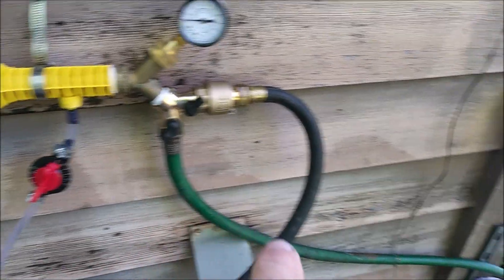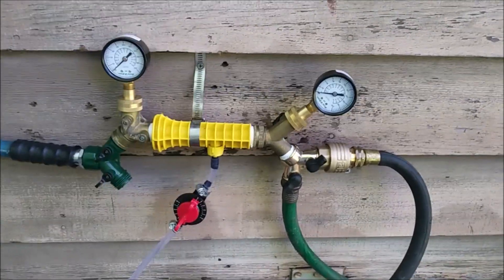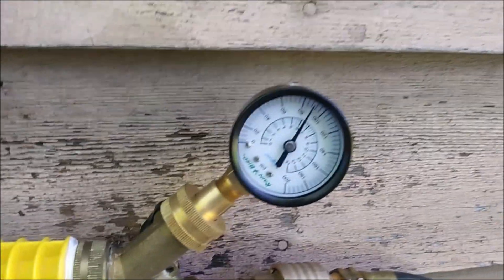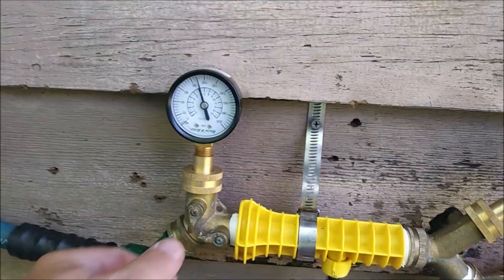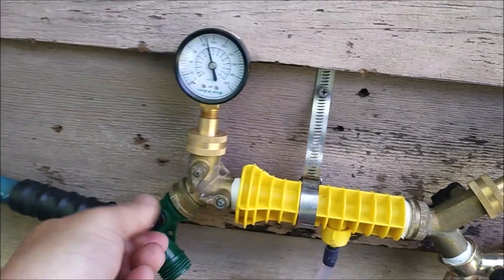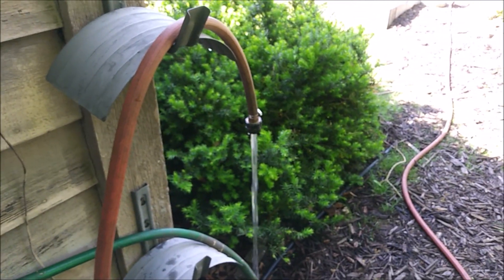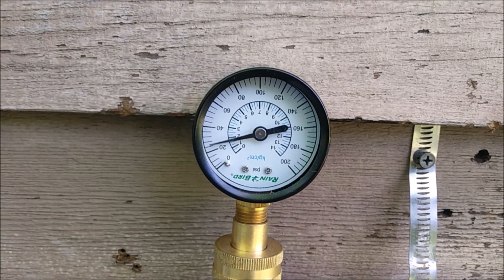The other option is a short hose, about six feet long, so I can tell the difference when testing with a long hose versus a short hose. The first thing I'm going to do is turn on the input at full power. You'll see the pressure come up on the input side, and that will also be reflected on the output side. It normally spikes above the normal input pressure because it's got a rubber hose. If I turn on the output to the large hose, we'll get the water flowing.